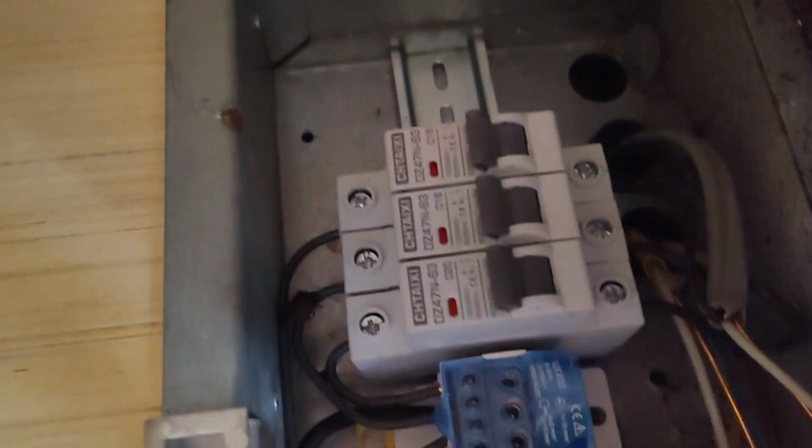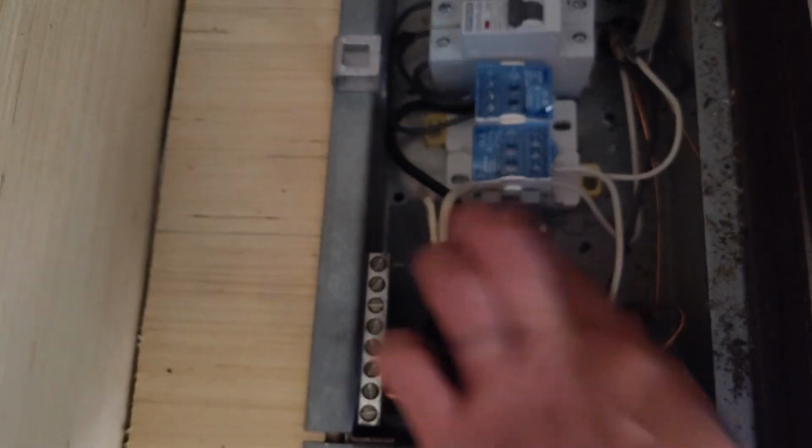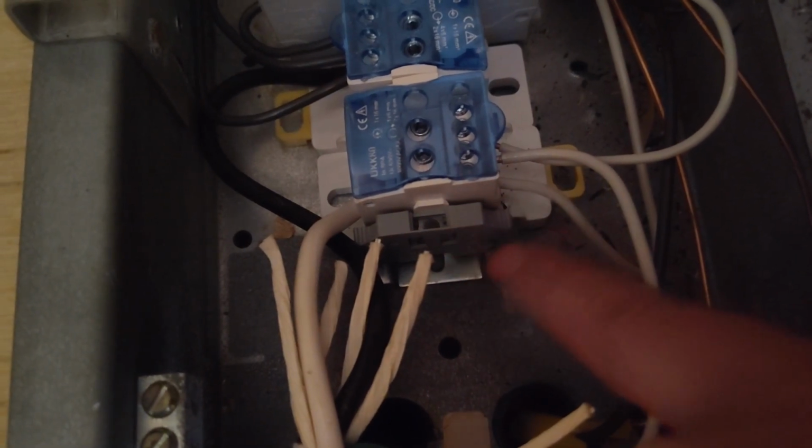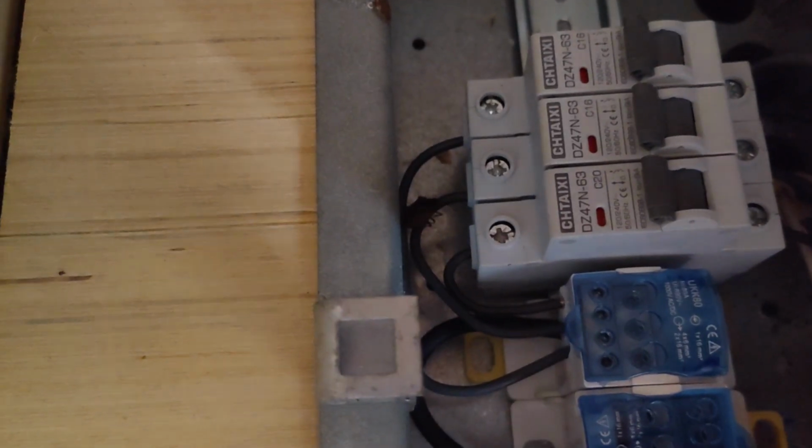And then I bought these breakers off of Amazon, and these snap onto a DIN rail. Now, if you're doing it this way, these end pieces here prevent these from sliding off. They kind of snap onto the DIN rail. There's one on both sides here. Of course, it gets really dark back here, but there's one right there too. So they snap on and kind of pinch into the plastic and won't allow these to slide back and forth anymore. So these are kind of nice because you have the input on one side, and then it goes through the breaker and then out to your wires.